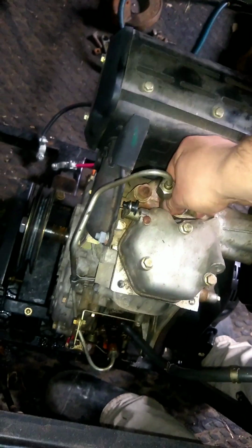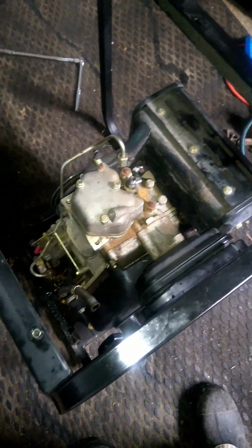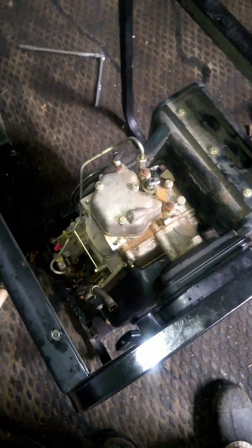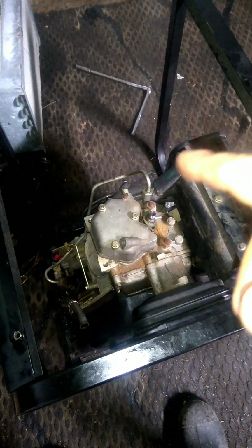And honestly, this engine, even being Chinese, it doesn't faze me a bit. It runs just fine. I have used black diesel in this. And when I say black diesel, I took it to the worst extent you possibly could. Thank the Ford IDI guys for the idea, because they're the ones who said, I just take waste oil and I dump it straight in the fuel tank of my truck. Well, that's exactly what I did with this, because I said, let's see just what happens. How bad is that? How long will this thing run without failing with just straight waste oil in the tank? Not filtered, not cut, not thinned, not actually black diesel, but just straight waste motor oil.